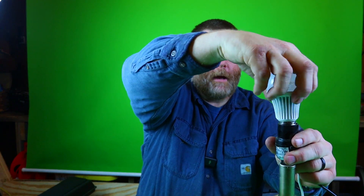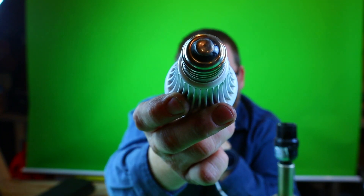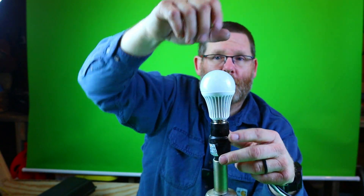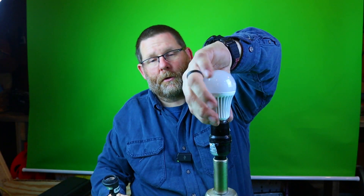If you were to put the hot on the neutral, you potentially would energize this whole entire shell. So when you look down in there, all that aluminum color would be hot. And a bulb, no matter what kind of bulb it is, the only thing that gets hot on this bulb is right in the middle. That's the only thing that gets hot. Your neutral is all around through here. So if you unscrew it because your on-and-off doesn't work or whatever, and you go to grab your lamp, you're going to grab it and you potentially could be shocked.